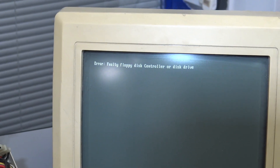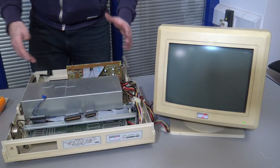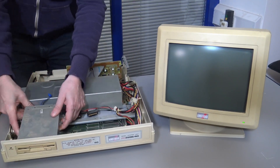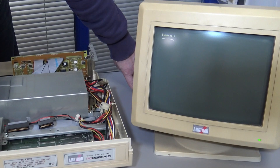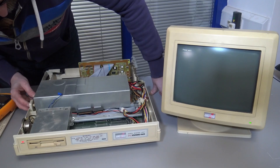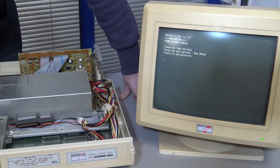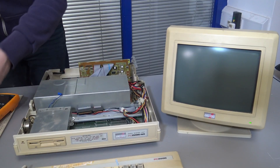Wow, it's working! You can see: faulty floppy disk controller or disk drive. So let's connect up items one by one. I've just connected up the floppy drive. Let's try a different slot — there we go. Please set date and time. Please check keyboard.